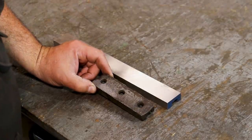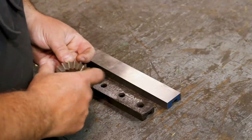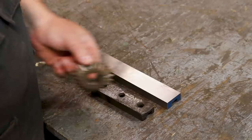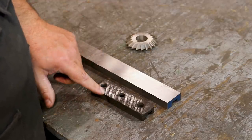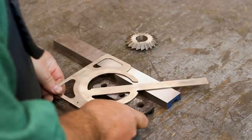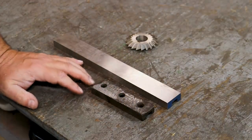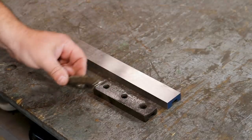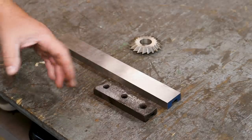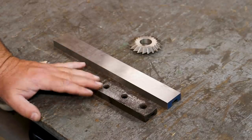This is the serration on the front. I've already done a little figuring. I've got a horizontal milling cutter with a fairly sharp V in it that matches this pretty well. I'm going to set this up over on the mill, come in at this angle and cut across. These measure about 25 thousandths of an inch deep, about a hundred thousandths apart. According to my protractor, they're at a 50-degree angle and run in both directions. We'll set the cutter up, make all cuts in one direction, then swivel it 50 degrees the other direction and make all cuts again.